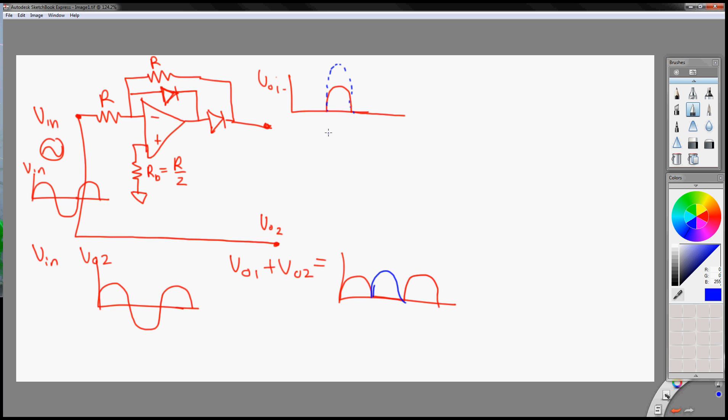So what we'll do is we'll fill in the gap by using an inverting amplifier at this stage. So we need to put a resistor here, here, resistor here, and connect that here. And it goes to the feedback, a negative terminal, and that's a feedback resistor.